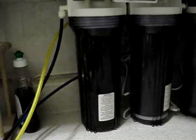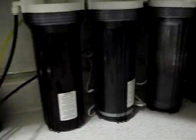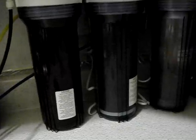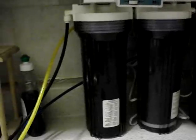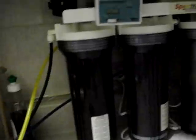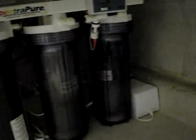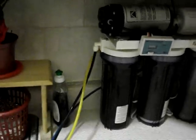The first stage was always getting dark. I've been collecting water with these first two stages for a while, and the carbon one is also getting dark — so the volume of water going through it is probably clogging the filter faster. The way this filter works: first stage is the sediment filter, then the carbon, then it goes up into the RO membrane, then back down into the two DI resins. It's got the yellow line for waste water and the blue one for product water.